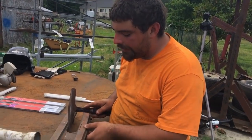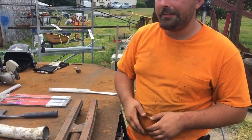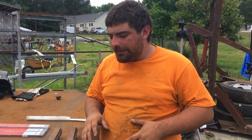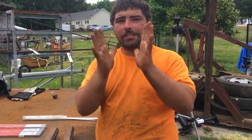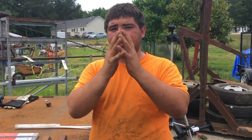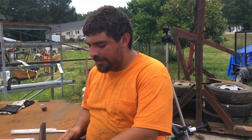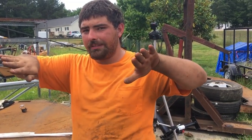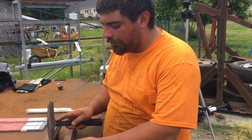You're just going along the weld and doing that. And what that does is you're literally causing the weld to push out like this to relieve the retracting stress. That cast iron gets hot, it pushes out like this into the crack. As it cools, it starts pulling back. And what you're doing is you're taking that chipping hammer and you're almost imagining you are pushing that weld down and out. And it just relieves the stress. A little bit of that shock as it cools relieves the stress.